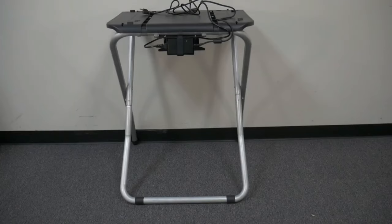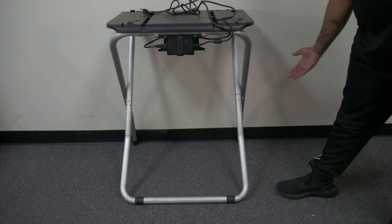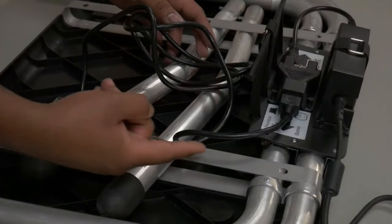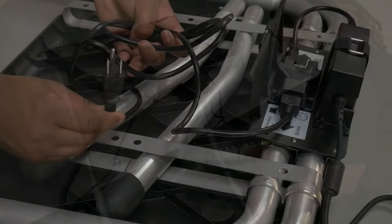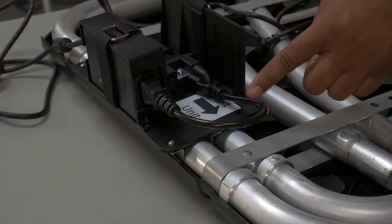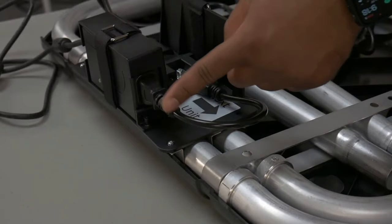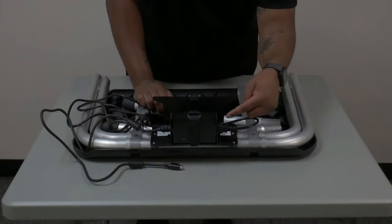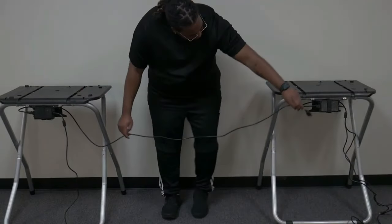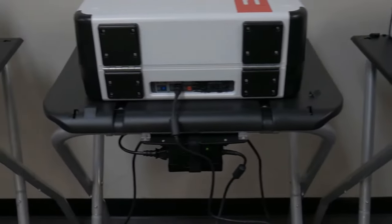The daisy chain power kit allows each booth to supply at least one other booth with AC power. Located behind the power adapter on the left is the long AC power cable, which supplies the booth with power — plug it into the surge protector. To the right of the adapter is the 6-inch AC power cable, plugged into one of two outlets on the kit; the second unoccupied outlet is where the long AC power cable from another booth plugs in. Each booth runs the long AC power cable to the booth before or after it in line. All AC power cables must run in the same direction for a given voting line.